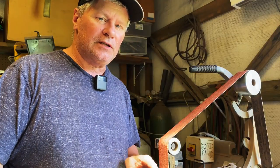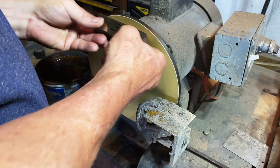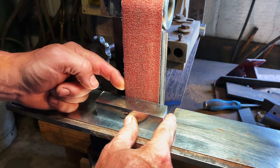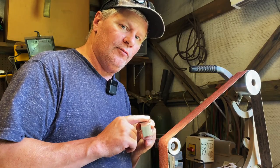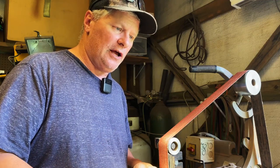One of the main reasons I like to use a disc sander instead of my belt grinder and a flat platen is that when you push the steel up against a flat platen you're going to have a little bit of rolling — you're pushing against a belt and that belt will give and come over the top. It's very small but it can roll and slightly dome your piece. You can certainly do it that way, especially if you don't apply too much pressure, but you really need this as flat as you can get it and I prefer the disc sander. I could use my surface grinder or even my mill, but the disc sander is fast and it gets it flat. Just a quick tip.